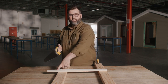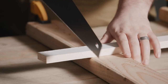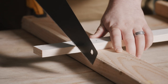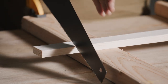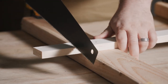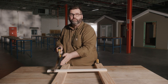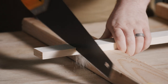As we identify where we want to cut, we want to start in a backward motion — just go in a backward motion to start the cutting process. You may have to do that one or two times to get the process started. Once we've done that, we have an area to guide our saw. Just make sure you're using the saw blade and not trying to push too hard. If you push too hard, the saw is going to bend and won't be able to glide through the wood. So go in a nice smooth motion, allowing the blade to rip through that wood.